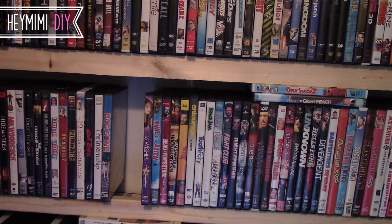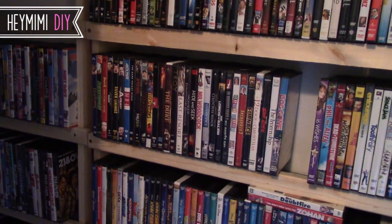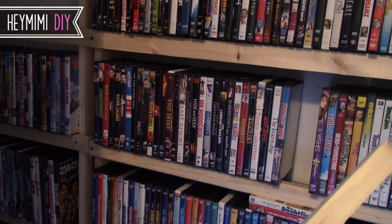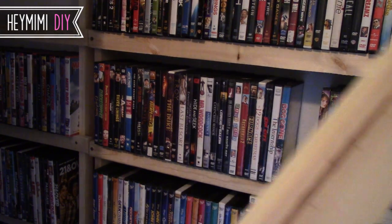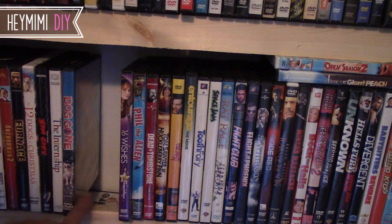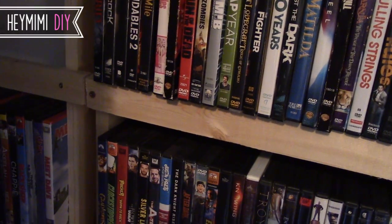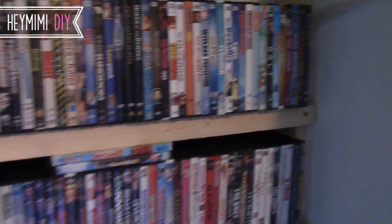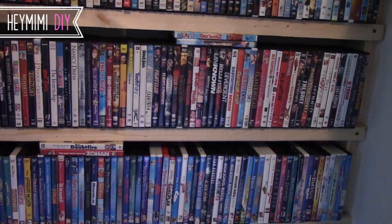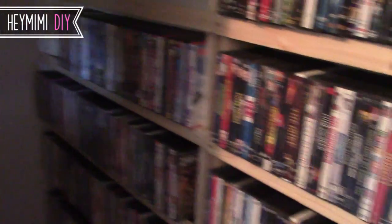I only made them four feet wide so that they would be able to support the movies. The uprights are made out of one-by-fours — they also come in eight-foot lengths and I had Lowe's cut them into five-foot lengths, which left me with three-foot pieces left over. The DVDs simply sit on the edge of these, and all I had to do was screw the horizontals into the uprights. It easily holds 75 DVDs on a four-foot long shelf.